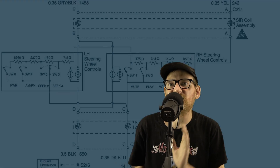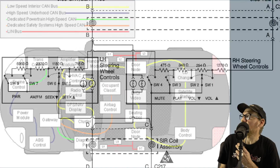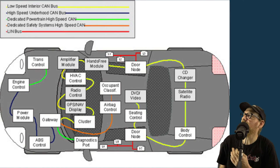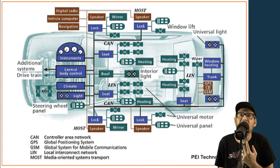The method I'm going to show here today only applies to vehicles that use a resistive divider for the steering wheel buttons. Some cars use the CAN bus, which is basically the car's internal network, and though this certainly can be done, this method is not covered in today's project — but stay tuned for more on that later.